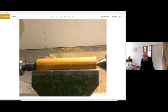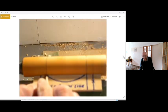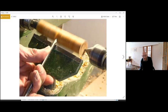And I put that pencil line on again to make certain that I'm using the 2 points that I marked at 7.2 mil. I mark the position while I'm still in center. The position using the cut line of the lid and body. I mark my 2 turning points for this concave piece. I've now moved it from center to off center.